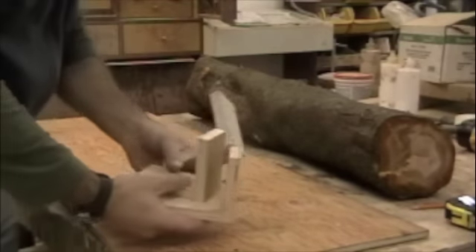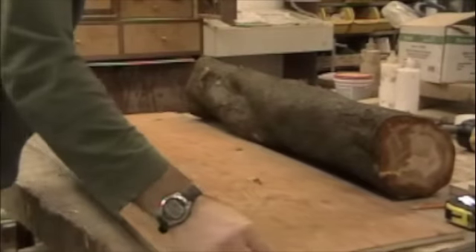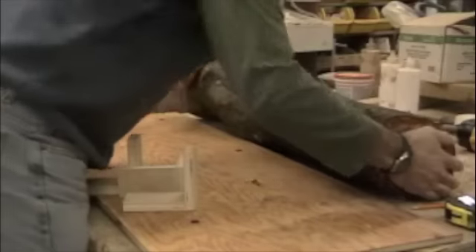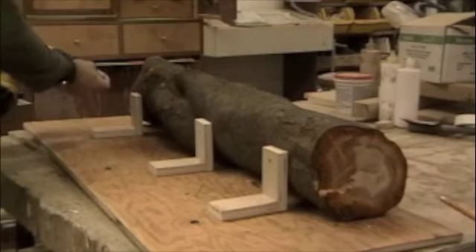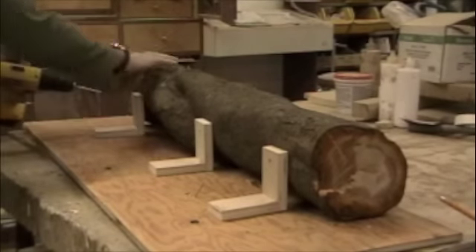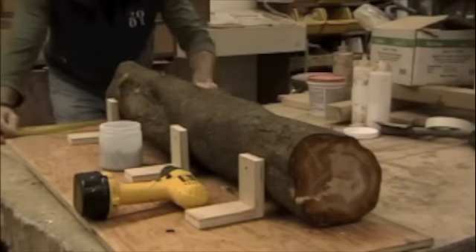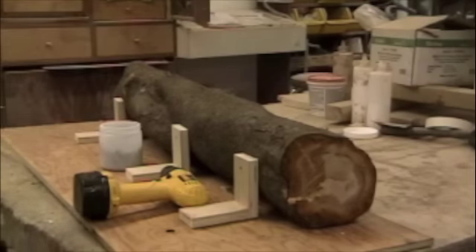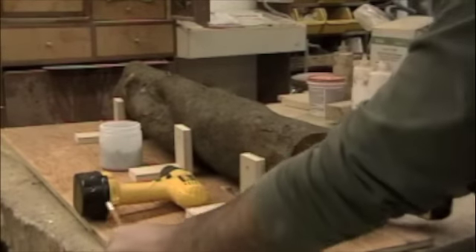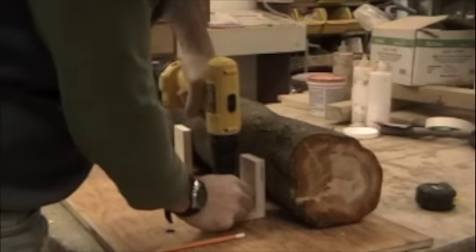The first thing I need to do is use these three support blocks made from scrap plywood, plus another piece of half-inch scrap ply that's basically 18 inches wide by 48 inches long. I need to secure this log to the plywood using the support blocks. I'm lining them up and screwing them down — the blocks are about one and a half inches wide by three inches long. Then I line up the center pith of the log off the outside edge of the plywood, checking that the measurement is equal on both sides, so I'll get a straight cut and a nice straight edge off the piece of plywood.